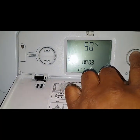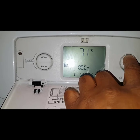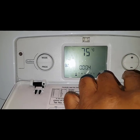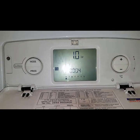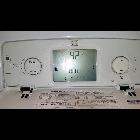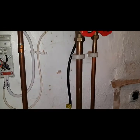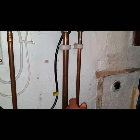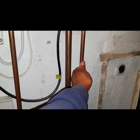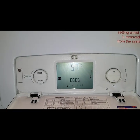I'm just checking the thermostat setting — that's at 50°C, that's no good. Let's make that higher — that should be about 75°C. That could give a bit more ammunition for our problem. It's just fired up now. What probably happened is because it was set at 50°C, we got to temperature and that's why the water wasn't very warm — the primary temperature was only at 50. Let's feel that — if it's getting any warmer. Yeah, it's getting a lot hotter now. We'll see what temperature it goes up to.